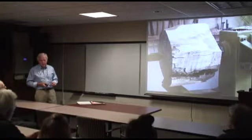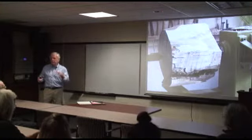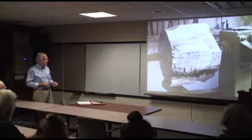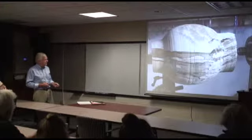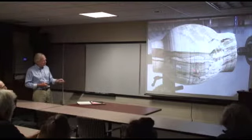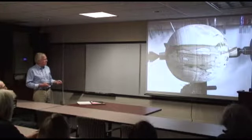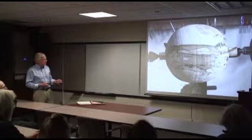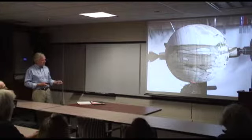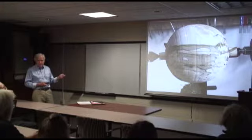But there's still beautiful parts in that. And so I put this on with the intention of making a hollow form based on the sphere, not necessarily, but spherical. So I removed most of the wood, and I can see more and more what I'm getting at here. A good third of it has this nice color, and the rest has some nice ripply grain figure. And so at this point, when I've got a sort of round object, I made the decision that down here is going to be the top, which I'll hollow from, and down there is going to be the base.